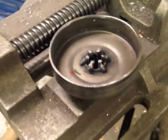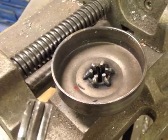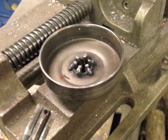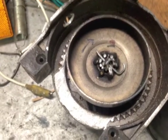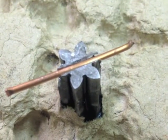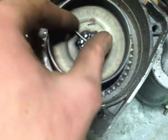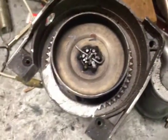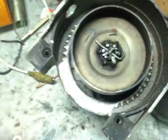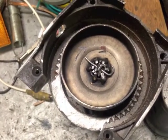I finally worked out how I was going to mount this thing — that was to drill a little hole through the end of this here, so I could just run a piece of wire through like a cotter pin. The little drill bit snapped off inside and I can't get it out no matter what I try. That took way longer than it should have, but I got it. I just ended up cutting a slit in it, put a piece of copper wire in it, and then welded over the top. The steel didn't stick to the copper wire, so I just pulled it out again afterwards, and I can stick a piece of steel wire through here like a cotter pin. It won't really have anything pulling it up, so it should be fine — I probably could have just tapped this onto the shaft gently with a hammer and left it, but I like to be on the safe side, and that just cost me a couple hours.